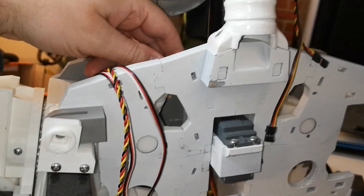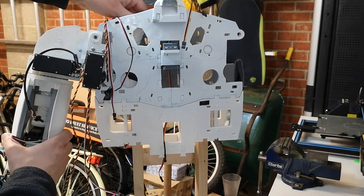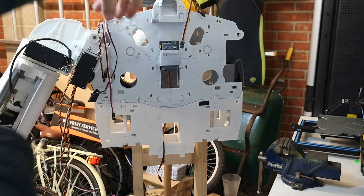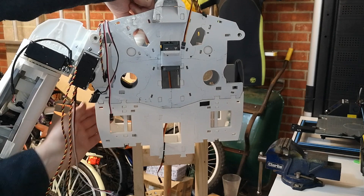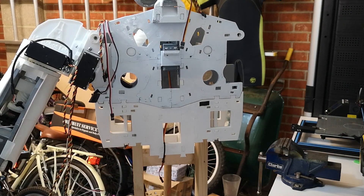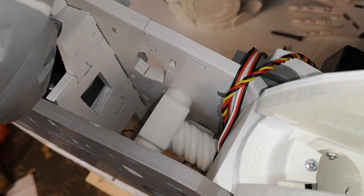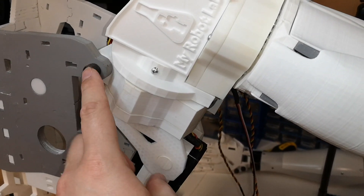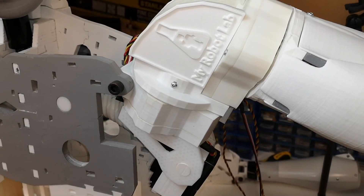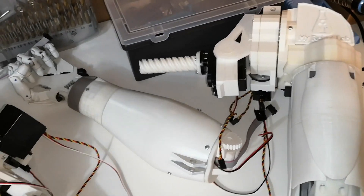What I'll do is turn this piston and get the shoulder up as high as we can get it, and I'm hoping we can just turn the piston and get this out by hand. I've got it as high up as I can — you can see it's wound right back as far as I can go without it coming right out. I probably could take it all the way out but I can't quite get it, so I'm going to remove this bolt and wind the last little bit out.